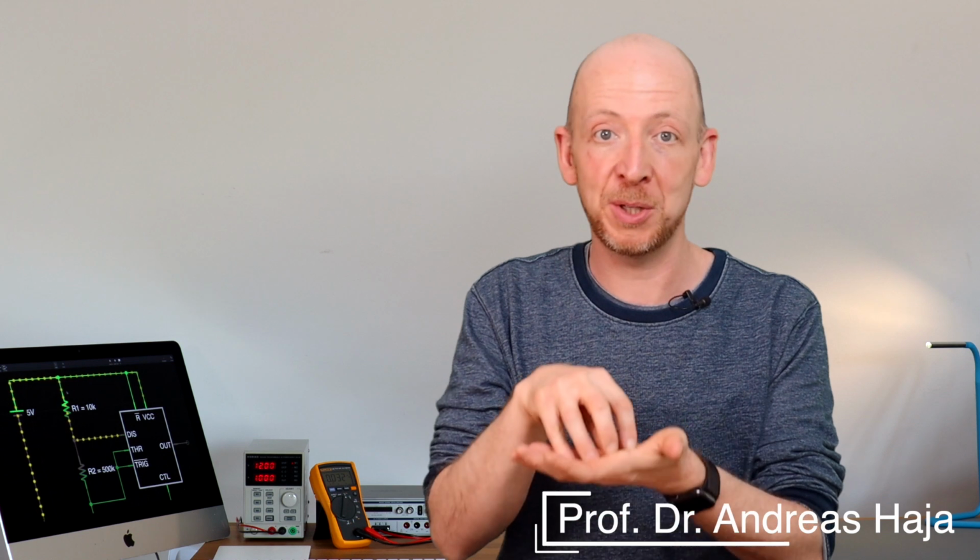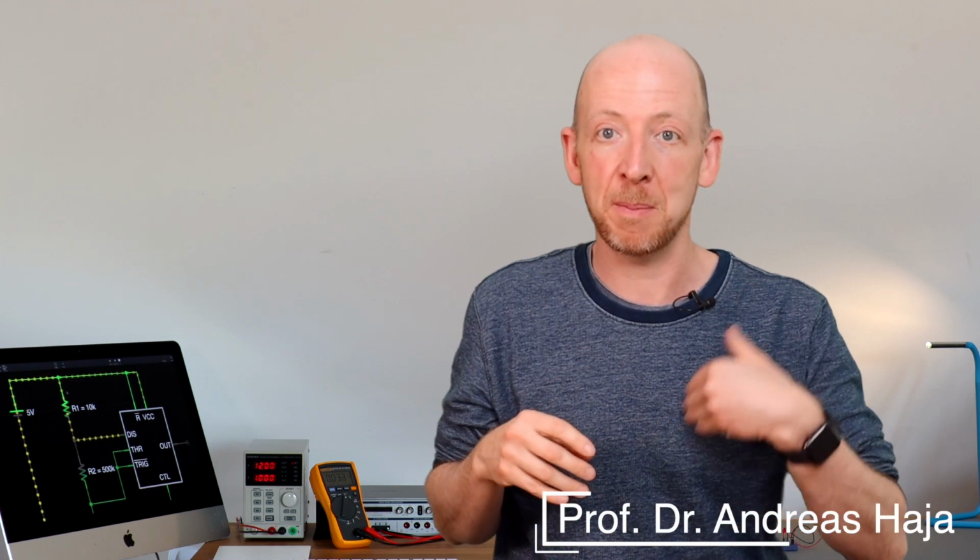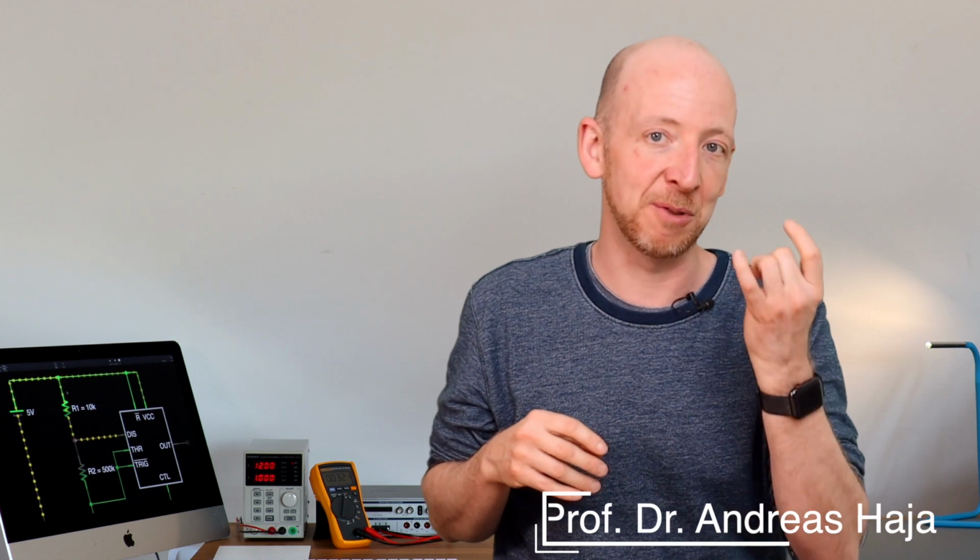In this video I will show you in a quite unique experiment what the term electrical resistance actually means. I will build two resistors of varying length from a piece of Play-Doh and two copper coins and then use a multimeter to measure if the resistance value changes as predicted by the theory.